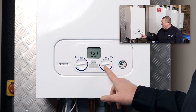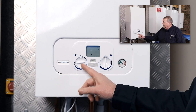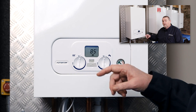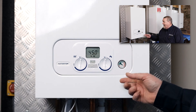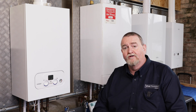First of all, we put both control knobs from maximum round to minimum — the hot water control we turn to minimum, same with the central heating, turn it round to minimum. Then we're going to turn the hot water on a quarter turn twice, so from 12 o'clock to 3 o'clock and do that twice. That will instigate the boiler going into chimney sweep mode. We'll know it's gone into chimney sweep mode because the screen will come up 304.